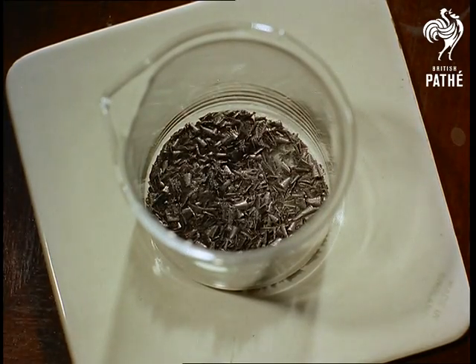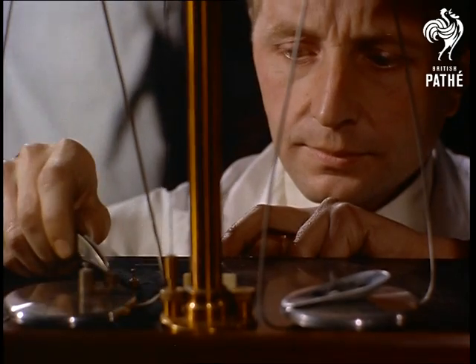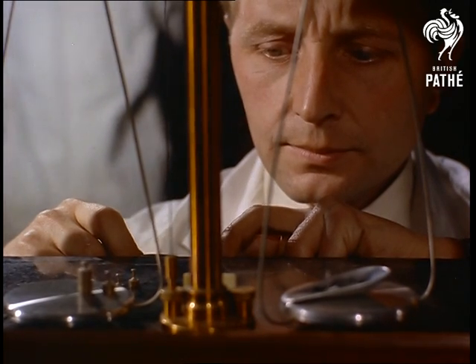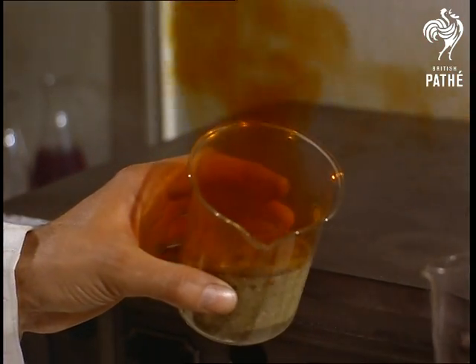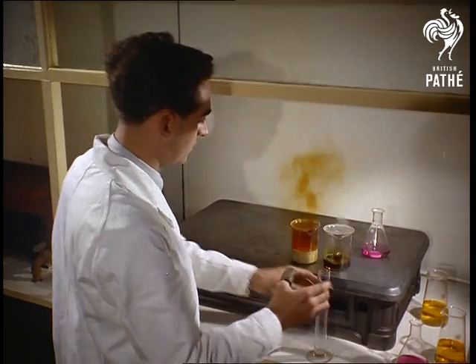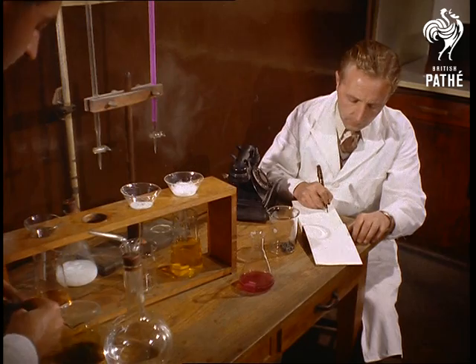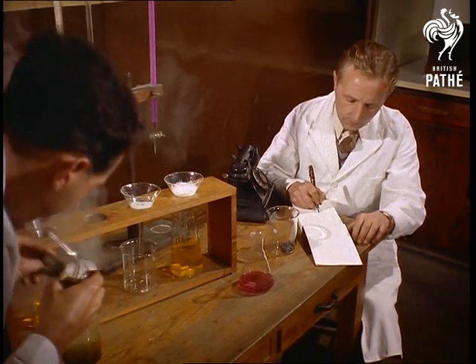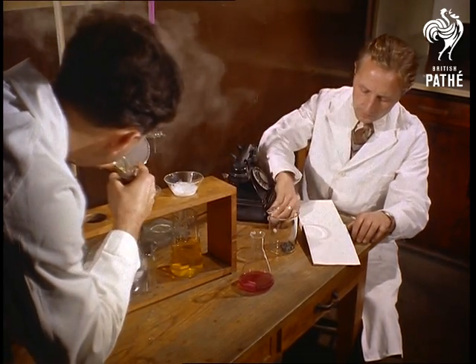Metal chippings of the samples from the furnaces are sent to the foundry laboratories for analysis. After being weighed, they are dissolved with chemicals to check the various elements in the metal. In the laboratory is the key to the high quality of Morris castings. Maintaining an all-round-the-clock vigil, a group of technicians ensure that only the very best metal is built into Morris engines. They are in constant touch with the metallurgists in the foundry and no tapping is made without their approval.